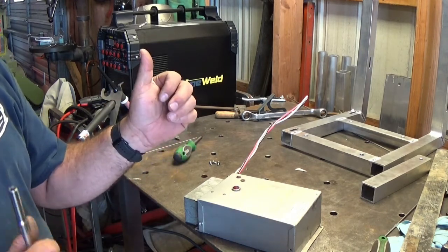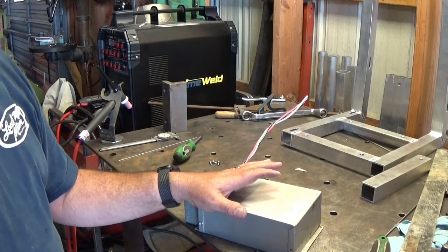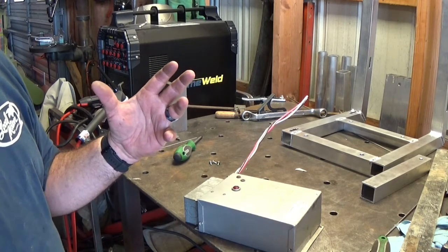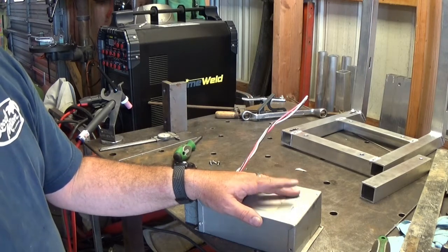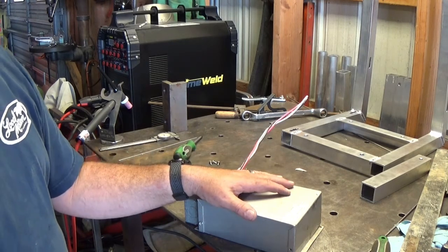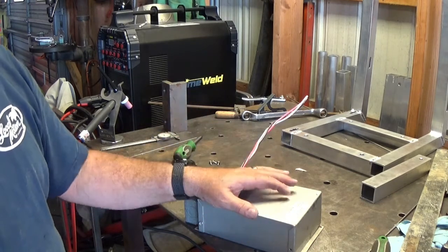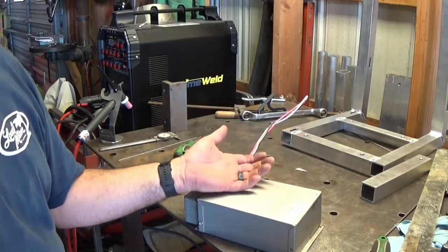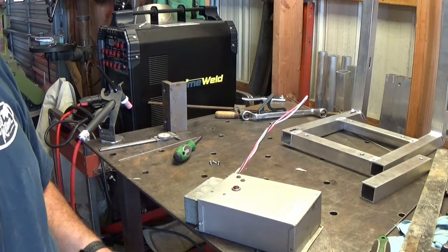Usually you just flip a switch, hit your button to start the motor, and once it's up and running you let go and it'll run off 220 as a three-phase motor. It doesn't have quite the same horsepower though. Starting and stopping a lot is hard on the capacitors and the box. My lathe won't run off this — the motor's too big. This is rated for a minimum of 3 horse, maximum of 5 horse. My idler motor is 10, but I have started it with this fairly consistently before since there's no load on it when it starts.